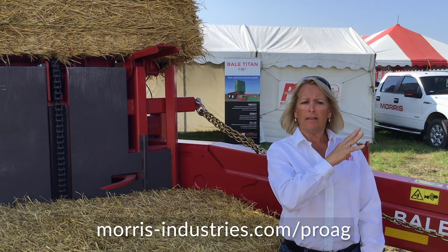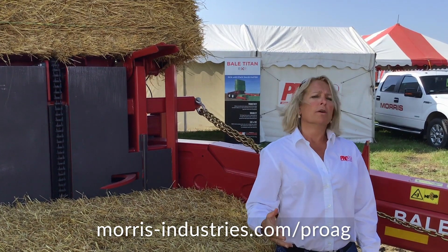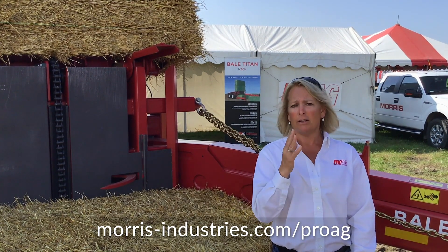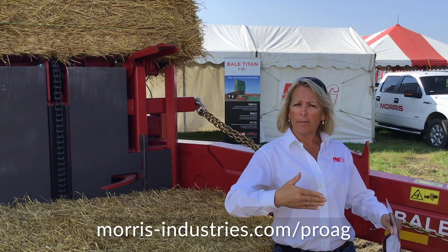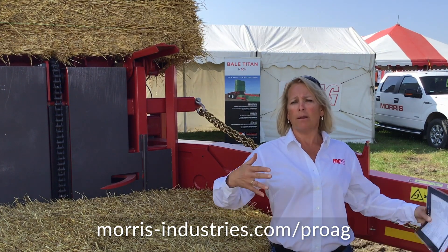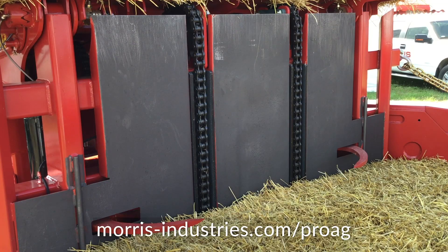The unit offsets to the right-hand side of the pulling unit. You can go into the bale in any direction — you can follow the baler, you can come across the field and approach it at any orientation. Using our alignment arm systems, you'll be able to manipulate that bale and turn it so it falls right inside the loader. The alignment arms are going to pick it off the ground so you're not dragging it while going into the second bale to pick it up and load them both on the machine at once.